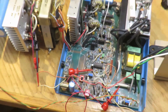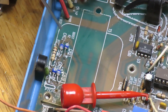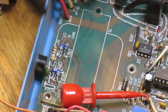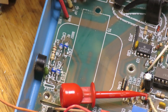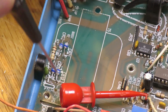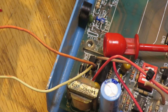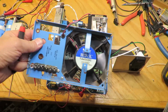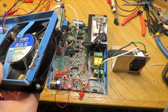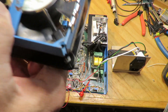I wired up the primary of the transformer and left the secondary wires dangerously floating free, hopefully not shorting to each other. I also figured out I was feeding the AC transformer into the wrong connector — that input is actually for the boost power supply, which is fed by a winding on the main transformer. The AC transformer actually connects through a four-pin connector that goes to the fan assembly, and the transformer mounts on the back of the fan.